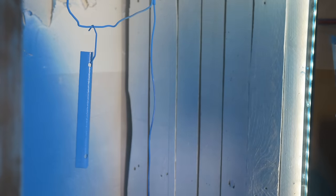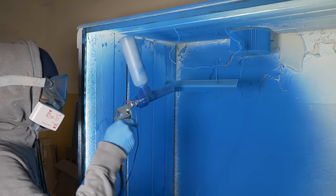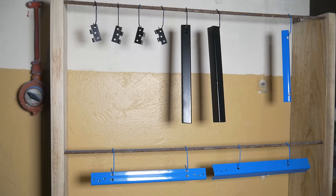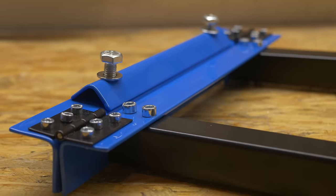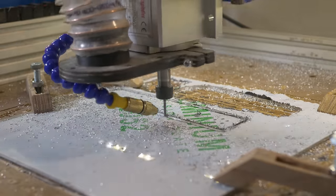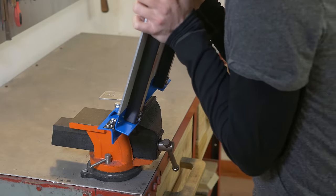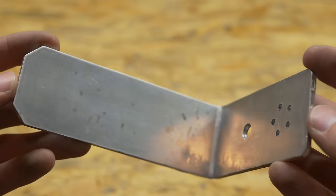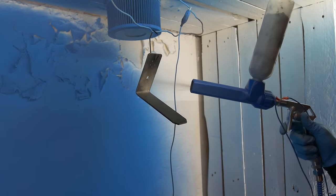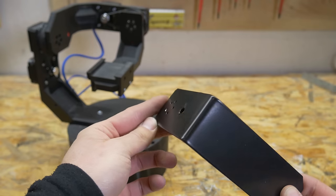Here I'm painting some parts for my mini metal brake that you might have seen in some of my previous videos. That was a really nice project with a really nice painting job — as you'll see in a moment it looked great. Here the parts are cooling down on a little cooling system I built from some spare parts I had lying around. And here is my mini metal brake with a really decent painting job — and that was easy to do. Here I'm also machining a piece of aluminum for one of my projects. This piece was painted black after being bent on the mini metal brake — three millimeter thick aluminum, quite thick. Here it is after bending and before painting, and after simply painting it black you can see the result: the finish, the smoothness of the powder coat is just perfect.